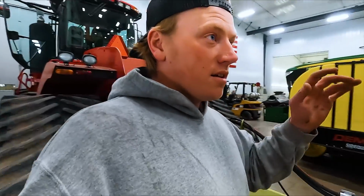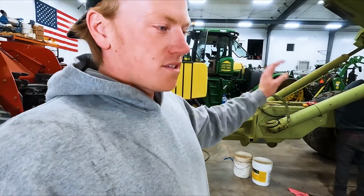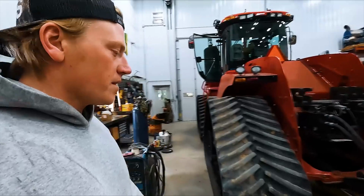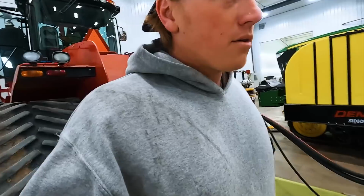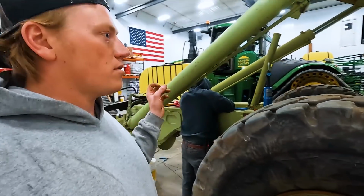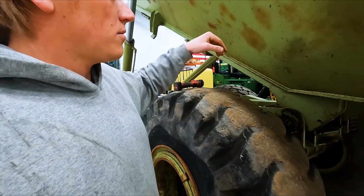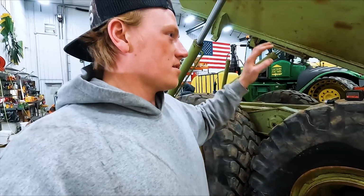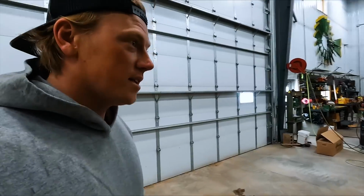So Brody and I are working on Dumpy 2.0 here. It came with brake lights, blinkers, and a reverse light, but when they cut the cab off, they also just cut the wiring harness for that, and so we just routed a new harness to plug into the standard power outlet on the back of tractors. Where Brody is here, is where they cut the harness, so we spliced them all there. The tough part was making sure you had the correct wire to the correct light bulb, because all the wires are dirty or have been painted over in this Steiger color. But we did get it plugged in now.